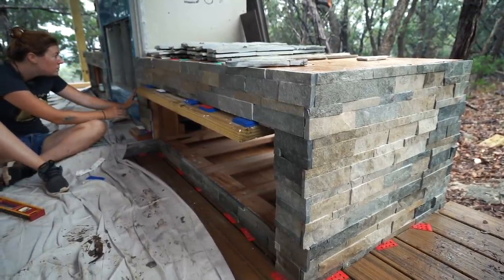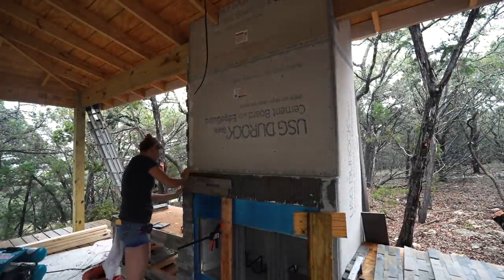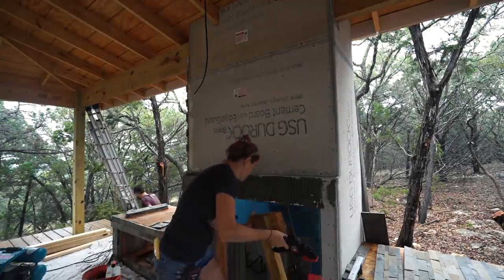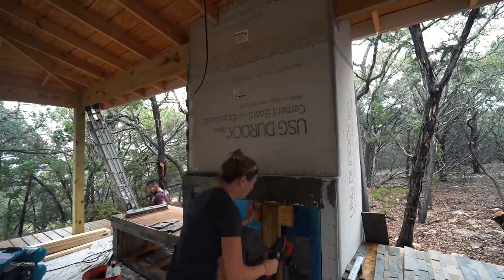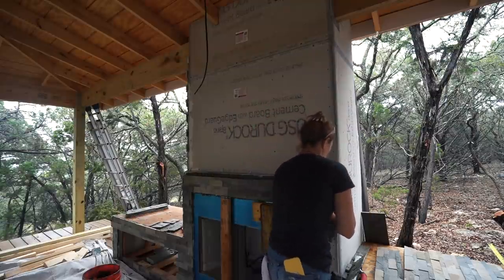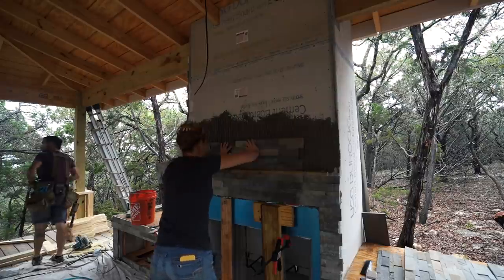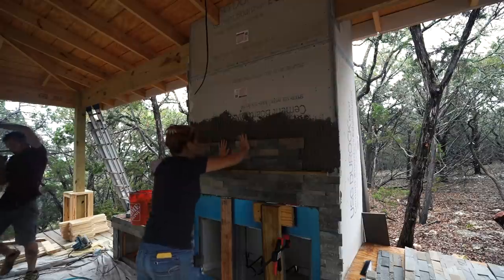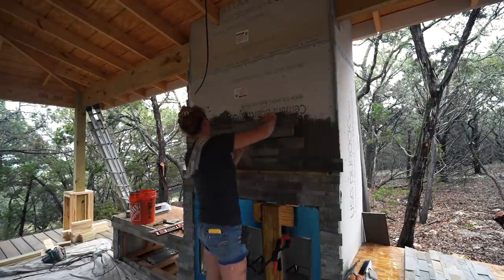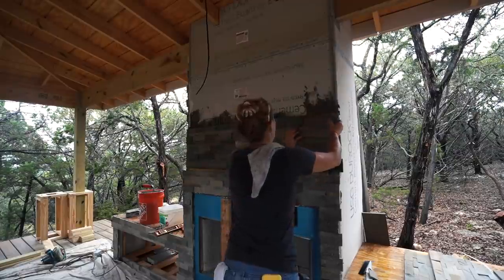It's amazing how quickly things start taking shape. After getting the log boxes done, I moved onto the fireplace itself, which is fun because it's much more open area where I was able to use more full panels of stone. I had to do the same thing on the first row of stone on the fireplace opening — this row needs to be supported from the underside, so I made some kickstands just below the height needed, then shimmed up to the exact height once I put a level on it. I jumped up an inch and a half to make room for the mantle. Cindy was kind enough to be my cut person, which meant I could stay in place and trowel on the mortar, stick things in place, and measure the small pieces that needed to be filled in.